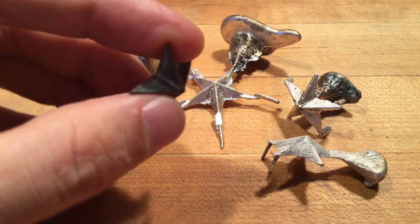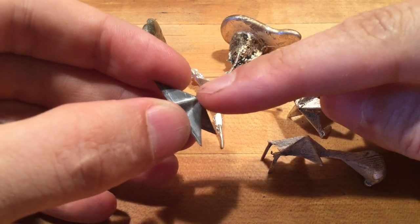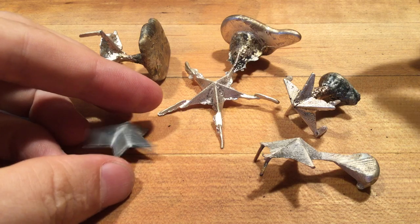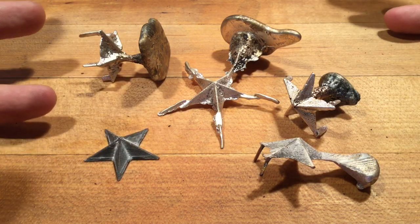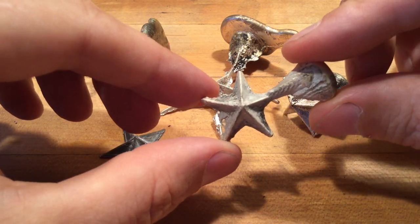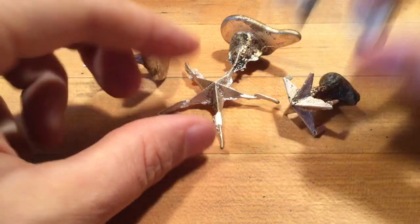With the drafted mold that we used in the sand casting frame, there were three separate orientations where the sprue came to the face of the star, to the back of the star, as well as to the point of the star. Through each sand casting test, we checked what orientation worked best and what working properties we saw. Because cuttlefish only allows for one, we just verified that when you sprue to the point, you get similar results. So we're gonna go through these one by one.